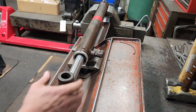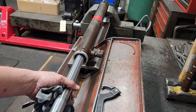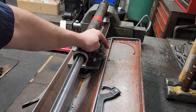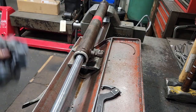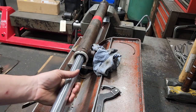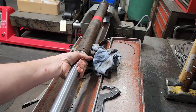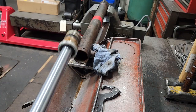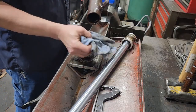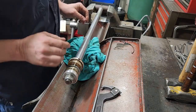Now it's a matter of pulling the rod out. There's probably going to be some oil in here — just a little bit. Cover this port so it doesn't blow out when I take and — basically you need to get that in far enough and then just pull it out. I'll set the tube to the side for now, put the rod in the vise, and put a rag down here to protect that rod a little.